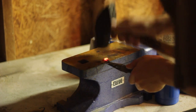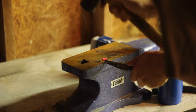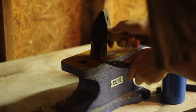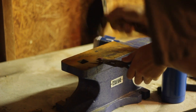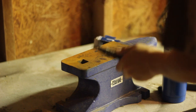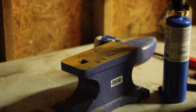I have this hot now. I'm just going to start drawing it out like the rest of them — getting it nicely drawn out so I can put a nail or screw through it later. If you can tap fast enough you can keep some friction on there and it'll stay hot. But you don't want to get it all done super fast because you'll have some pretty bad hammer marks, so you're going to want to take another heat or two to smooth those out so it'll look nicer.